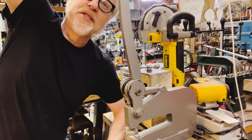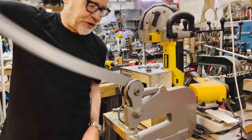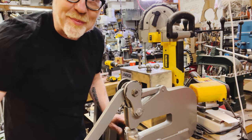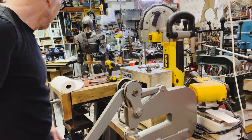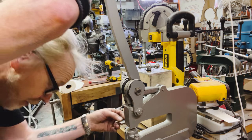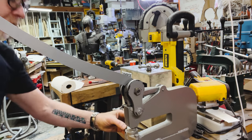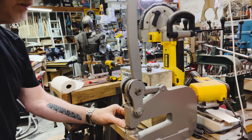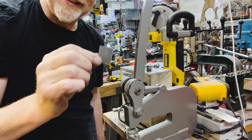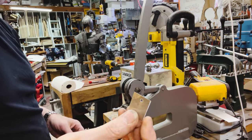So we bought this industrial punch, and Tom Sachs had always told me, dude, get thee an industrial punch on a workbench for like a standard 1/8 inch hole. It's just gonna make your life so much better. And he's totally right, it has. And here's how easy it is to make an 1/8 inch hole. Just come up here, put this right there, bring this down. There we have a little 1/8 inch hole, damn straight.